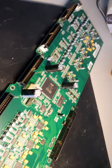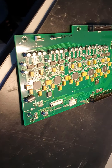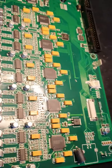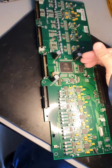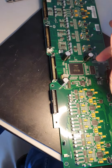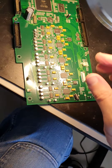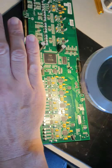I hope this video helps — there's not much support out there for these: no parts, no circuit diagrams. This is, I think, a later version of the mixer. On the earlier versions this board was in two halves: one half handled all the inputs with ADC — analogue to digital conversion — and the other half dealt with the outputs, auxiliary outputs, master outputs, and all of that. Now they've integrated it into one board on the later models.